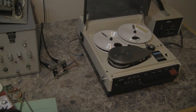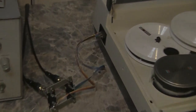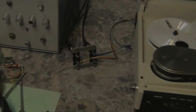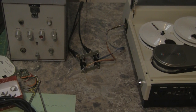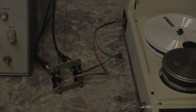To get this to where I could test it, I had to build an adapter cable. Taking an old sidecar monitor from one of the black-and-white machines, I scrapped it for a connector which is an eight-pin but not standard EIAJ. I ran the wires out to a couple of dual RCA jacks that you can buy at Radio Shack, and broke it out for the four signals: video input, video output, audio input, and audio output. This adapter, though very low reliability in the long term, is adequate for current testing.